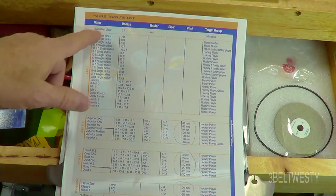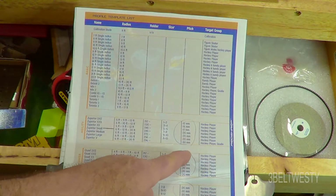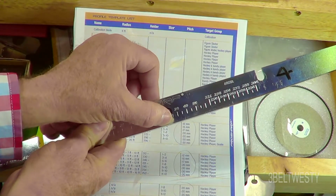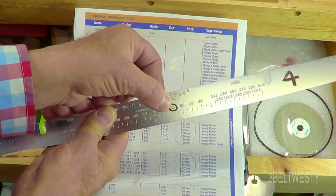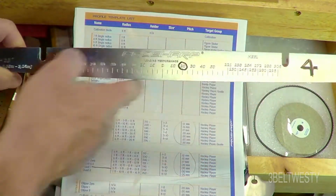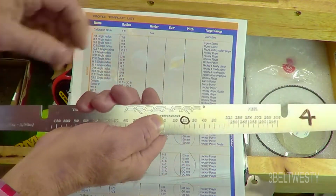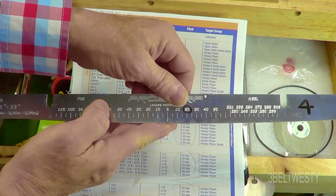Okay, on Prosharp's template list here, the pitch is actually a dimension in millimeters. It's a dimension from the thickness, the greatest bulge. A lot of these have a minus 20 millimeters here. What that means is, if you take this profile exaggerated, it curves out and goes back down. The greatest point is here, and it's generally in the heel region for some of these multi-radius templates.